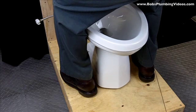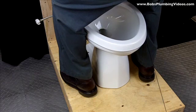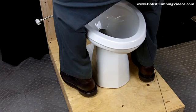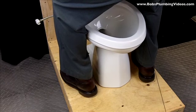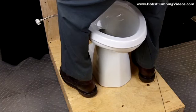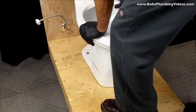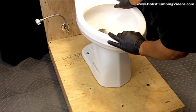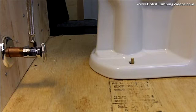That's fine, that's normal — don't worry about it. As you come down you're going to have to actually wiggle the bowl a little bit to actually squish out that wax. Now in the summer months it's relatively easy to do. When it's wintertime you may have to sit on the bowl to get that wax to squish out because it's cold. At this stage we're ready to bolt up and tie in our water supply.